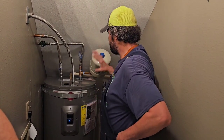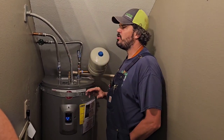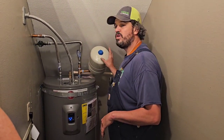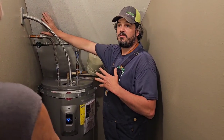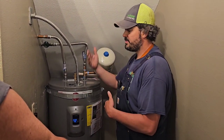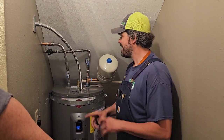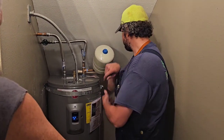I have to put that in the system. I can't leave it out. A lot of people want me to leave it out because they're like, oh no, our water system is open. It's in communication with the entire city's main, right? So then technically you wouldn't need that, because if there wasn't any expansion here, that extra expansion would just work itself out back into the main, right? But water systems, as the infrastructure grows, new water systems and meters, they have check valves on them now, because they don't want whatever the homeowner might be doing in here, hydroponics, whatever homeowners do, they don't want that to get back out and contaminate the neighbors in the system.